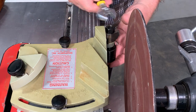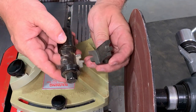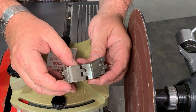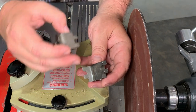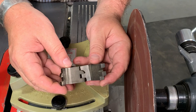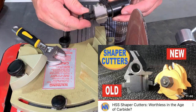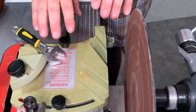A number of our cutters are made as mates — we've got male and female cutters. These two are mates for one another and they cut a mating joint on two different pieces. The more we remove from this face, the more it changes the depth and size of these, and we have to be sure that we remove the exact same amount from both to keep them a matched set. Not so simple. I'm going to refer you in a link below to Tom's video — I highly recommend watching that if you're going to be sharpening shaper cutters.